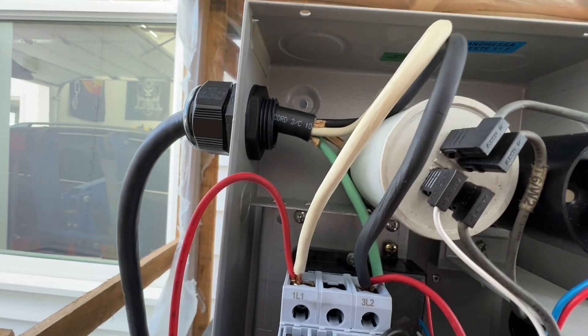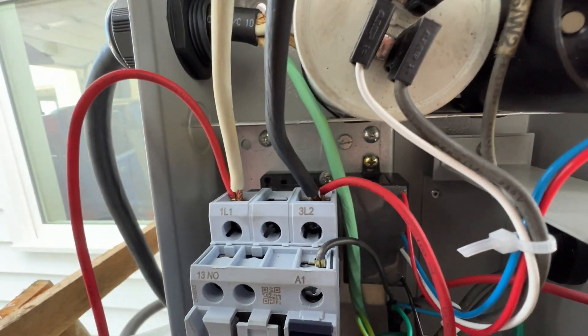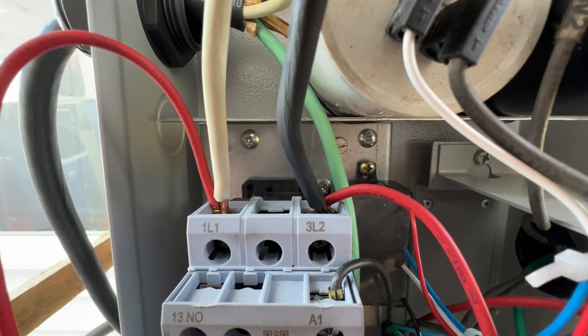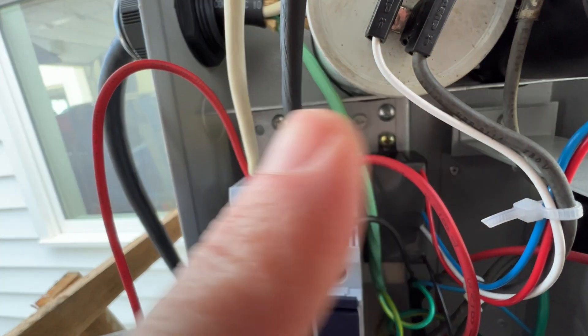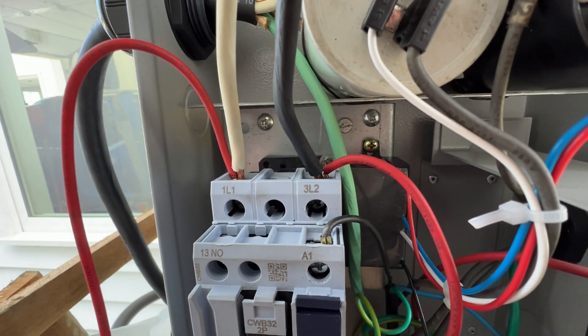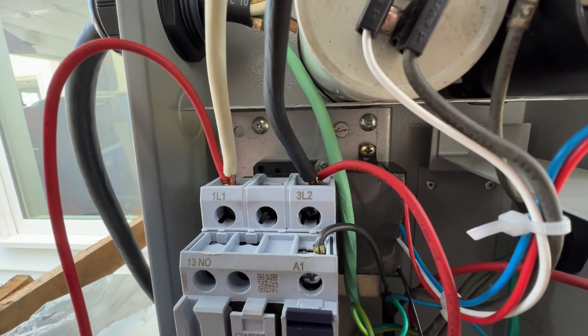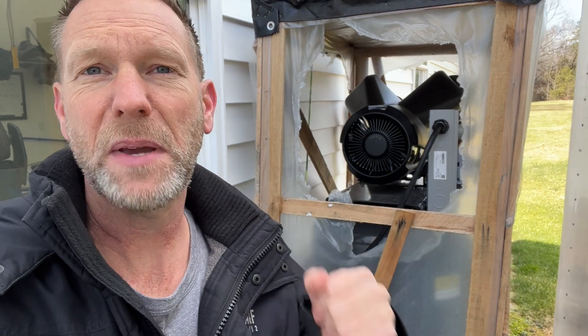The moral of the story is all you have to do, if everything works well, is take these three wires, put two in there and one down here, and you should be good to go. It is very important to make sure that those red wires are connected as well. For some reason mine wasn't working at first, so I checked all the connections and switched where my black and white ones went — which should not matter since they should both be the same — tightened everything back up, and voila, it started working. So if you turn yours on and you're just getting a click and nothing's happening, maybe that's why. If you have any issues wiring this, reach out to the guys at Schultz of America — they are a fantastic support group and very willing to help walk you through this. I've got another full video on the setup of this thing outside of the wiring, so go check that out. I hope you're subscribed, smash that like button, and I'll see you guys on the next video.